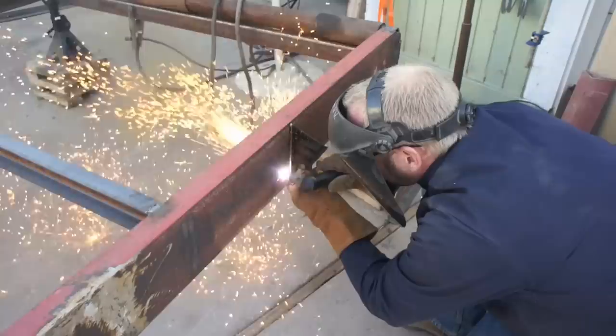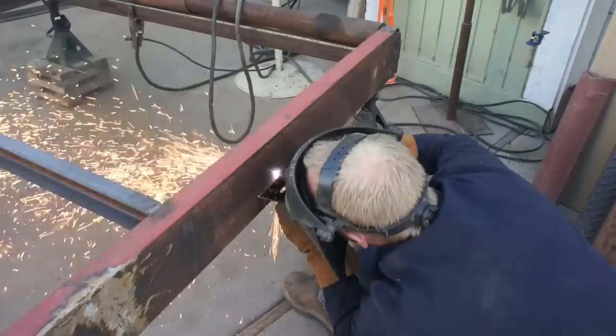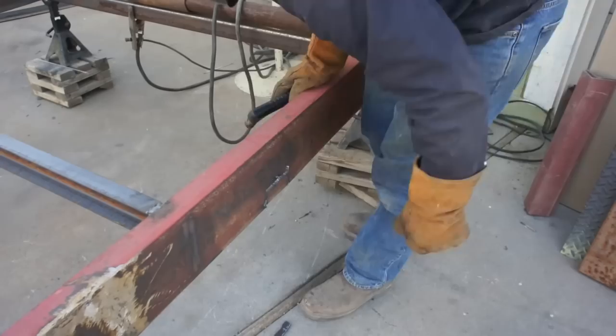These are the notches where the axles sit. This is a design that I'm copying off the original subframe, and I think it is a really good design. Not only does it hold the axle captive, but it also lowers the overall height of the trailer deck a full 2.5 inches because the axle is set up into the subframe.